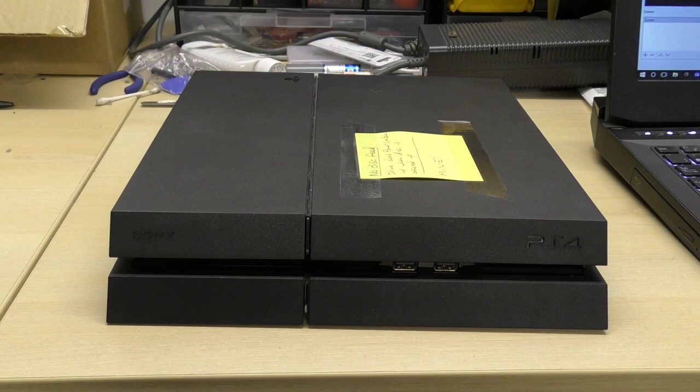Now, that's good in a way, because it means we can't get mismatched drive boards anymore. So for those of you who've come across them, and they're quite annoying, the CE-35888-2 errors because you've mismatched a logic board, or you've bought a machine where some git swapped the drive out and then put their old drive in there and then sold the old machine as faulty, the only way around that is massive surgery. So it's an APU Syscon NOR transplant along with a matching BD-ROM board, and that's just a pain in the arse. So, it's good in a way, and it would appear that Sony themselves got sick of fixing them,